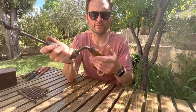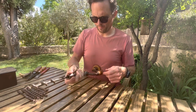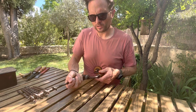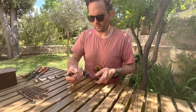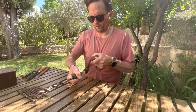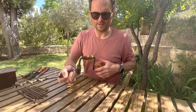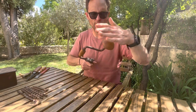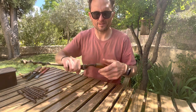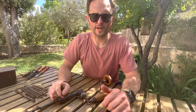The handle rotates to save any friction and blisters on your hand. There's also a pad on the end so you can apply pressure using your belly or whatever other point of contact you want to make, and then you can turn the drill. If you're working upright you would apply pressure with your hand or even your head to that end pad to apply pressure from the top.